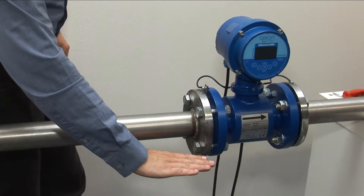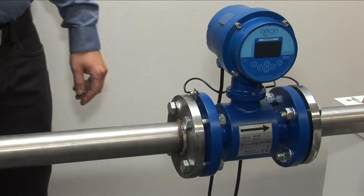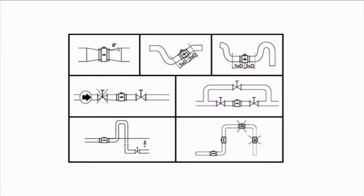Resistance to the ground should be less than 1 ohm. Any rust or poor connection will increase its resistance. Number 2: Pipe is not 100% full of liquid. An electromagnetic flow meter measures correctly only when the whole area is full of conductive liquid. Ensure by installation that the meter is full — you can use a siphon installation.